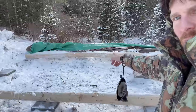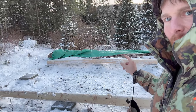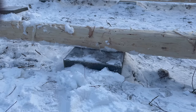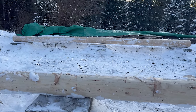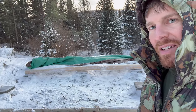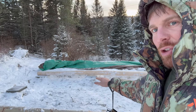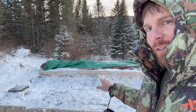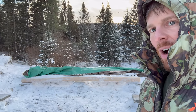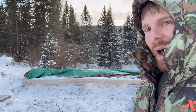As you can see over here on this one, that guy has a bow slightly outwards, and there's a gap between it and the middle pier pad there. Now, if I had the luxury of this being the summer, and I can go hunt through the forest and find another 10-incher to put there that's straighter, I would do that. But in this case, you know what? I don't mind that at all. I think I might put a few little shims in there, to make it have contact with the middle pier. And as well, I may even take my chainsaw and kind of shave off that bow on top so it's straighter. And you know, chinking is a beautiful thing, filling in the gaps. So I like it, man.